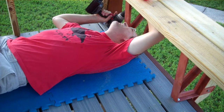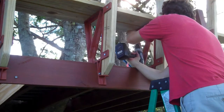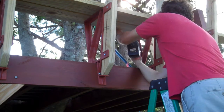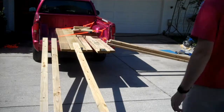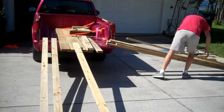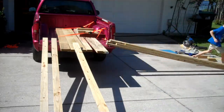You can lay on your back to screw these boards to the brackets from the bottom, but if you have access to the edge of your deck with a ladder, I found it easier to screw them in from that position. The plans call for several 2x4s to be used as backrests, as well as protective rails below the bench seats. You'll want to choose the nicest looking boards for your backrests and put the ugly ones down low.